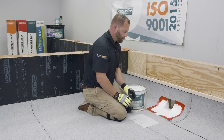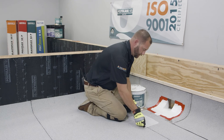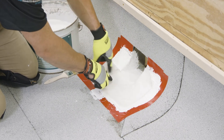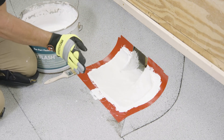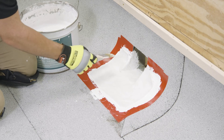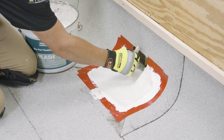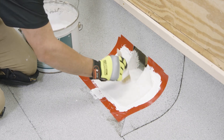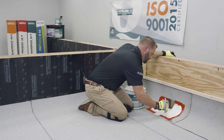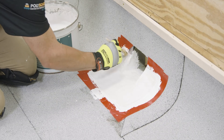Now that we have that fully encapsulated with our PolyFlash 1C, we're going to add in our last layer of reinforcing fabric to finish this thing off. We're going to lay this in fuzzy side down, making sure that it extends a minimum of one inch past the mod bit out onto that good clean metal that we're trying to adhere to. We're going to use our dry brush again to push the fabric down into the flashing compound. Once you see that compound coming up through the polyester fabric, you know it's grabbed a good bite and you're okay to put your last layer of PolyFlash 1C in place.